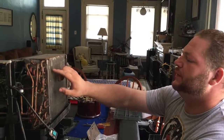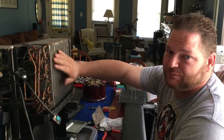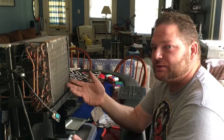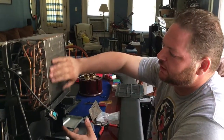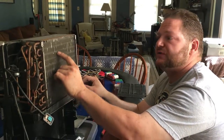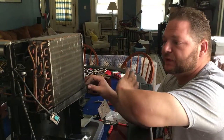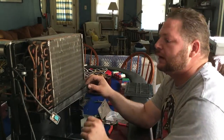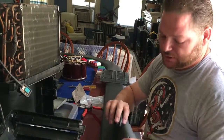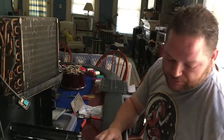I got everything cleaned up as much as I could. The dust on the evaporator coil was particularly nasty because the coil gets wet and the water runs off, so it mats the dust down pretty good. HVAC guys will use an evaporator coil cleaner for this, and you could use something like that here, but I didn't think it was worth running out to buy it. Just clean it off and make sure you can still see through the coils. One cautionary note when cleaning these coils - be very careful not to lay the fins over too much. It's very easy to lay them over, and I have seen coils where they're completely flattened and no air will flow through them. I was carefully scraping the harder dust off and then vacuuming with a brush attachment to prevent damage.